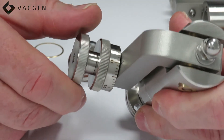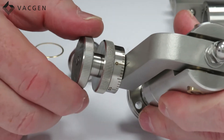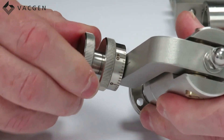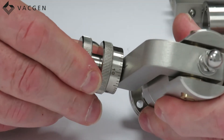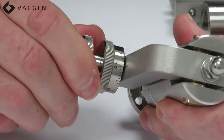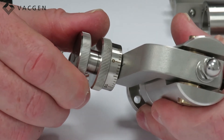The valve is very simple. You have an index mark on the arm and index marks on the wheel that goes around the thumb screw. You simply turn the valve until it starts to leak and then you can control the valve from there. The more you use the valve, the more repeatable it will become. To seal the valve off you simply turn it back to zero, and this will be leak-tight to 1×10⁻¹⁰ millibar litres per second.